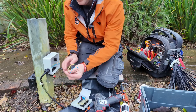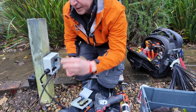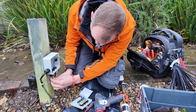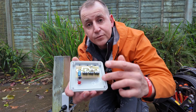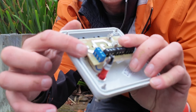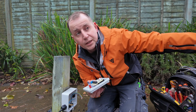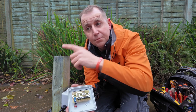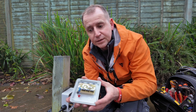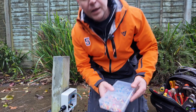This cable is for the filter and this cable is for the pump. On the back of this module we have several sets of terminals — the first one there is the supply in, and then these are the switches. So the cable that comes from the house goes in that terminal block, then pump and filter go in either of these. I might be super posh and ferrule these up.